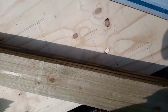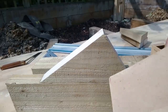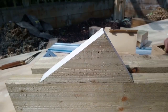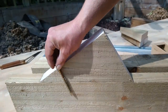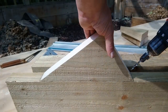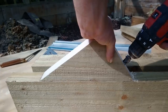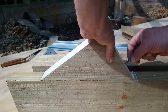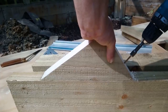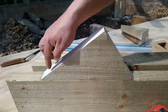There are three matching ones. I've got these little 100mm sixes I'm going to put in here. I haven't got too many of them so I'm going to put the 120mm eights in the top there. Can't have the head showing so I'm going to try and countersink them a bit. I'm going to stop there because when that tightens up — I've got my pencil line here — when it tightens it might pull it that way, so I'm going to put this one in a bit as well.